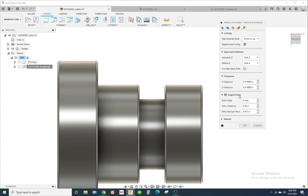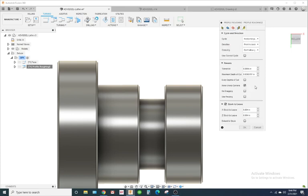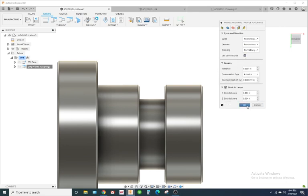Okay, so usually I have a lead in and a lead out. It's not usually called angled entry. It's called lead in and lead out. I have an entry angle. I don't have an exit angle. Okay, I guess that's something new. They're not gonna let me change that. They'll probably do away with that on the next update. Also, I would use canned cycle. Makes things simpler.